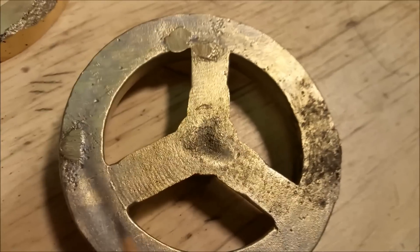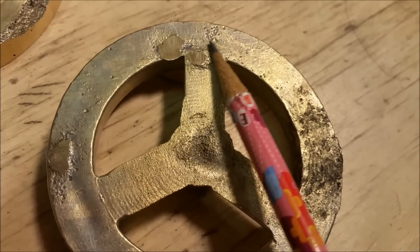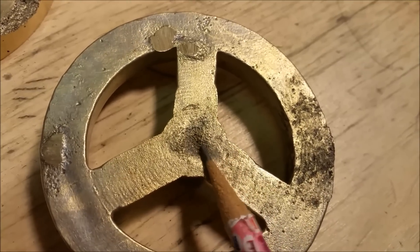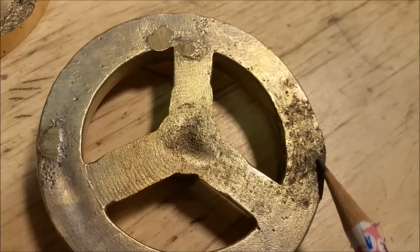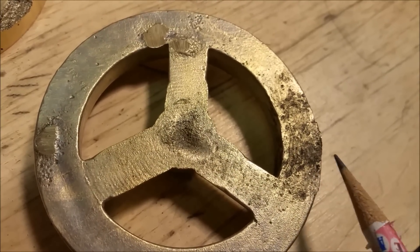Here are all the castings — number one, two, three, that one was highly polished. And then number four, done totally unauthorized by my son Jack without me knowing. And here is the Petrobond casting right next to the pattern. There are really amazing things here — you can see machining marks on the casting matching the pattern. There's some pitting mainly where the gate was. On the back side, here's a vent — it sunk a little bit here, and there's pitting near where the gate was. I think I need to make my gate considerably longer.